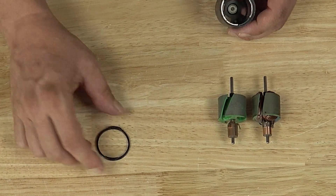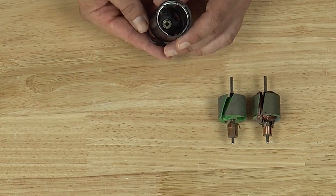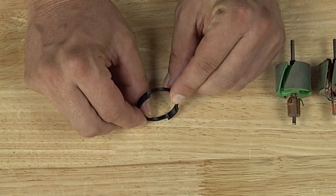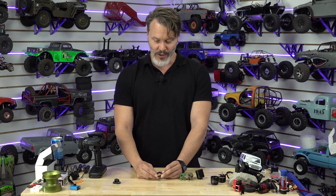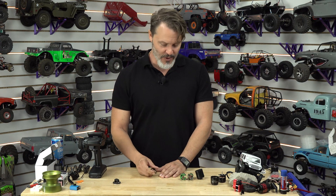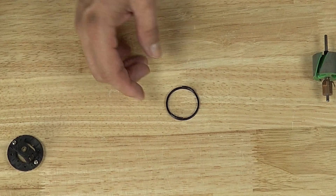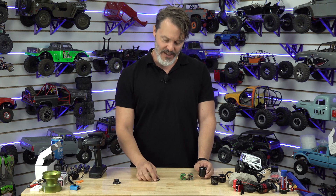It's pretty symmetrical too. What I ended up doing was printing these little plastic spacer pieces and shoving them down into the base of the motor can, then putting the magnets in. These little tabs — you can see them against the table — acted as our t-bar equivalent, the same as what I used with the magnets. Then it all got glued into the can, so these were consumables. But we're talking maybe a penny in material, and I can print a plate of them in an hour — far faster than we could actually assemble the motors. Once the two-part epoxy sets, these pieces are just trapped in there doing no work. The epoxy is what holds the magnets, so the fact that plastic softens with heat is irrelevant at that point.